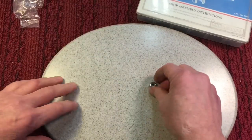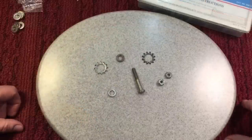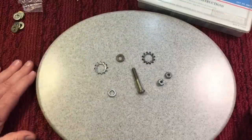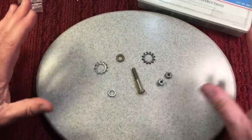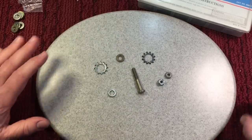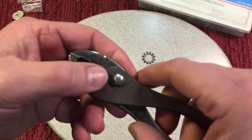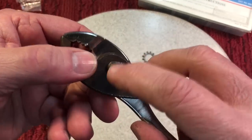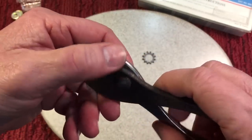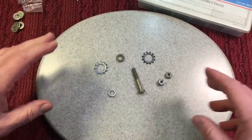That made me think: how many ways are there to lock a fastener onto a bolt? I've always been a little bit leery with ways to lock down a fastener. In the tool industry, what we do is we take a nut and peen over the top, and that's usually very rarely do you have these come off — they might loosen up a little, but they don't come off.